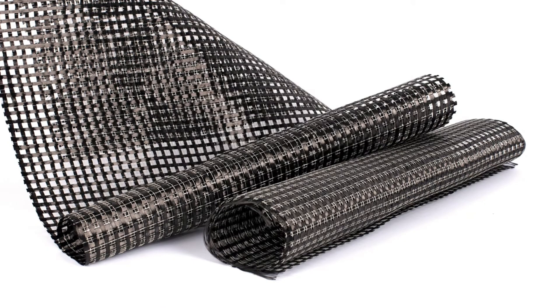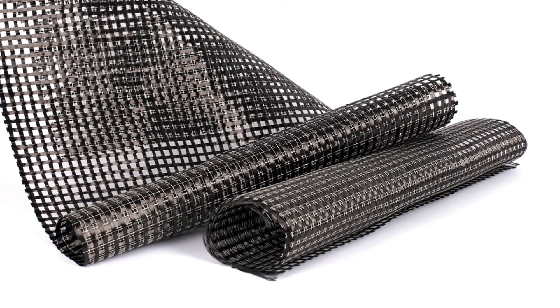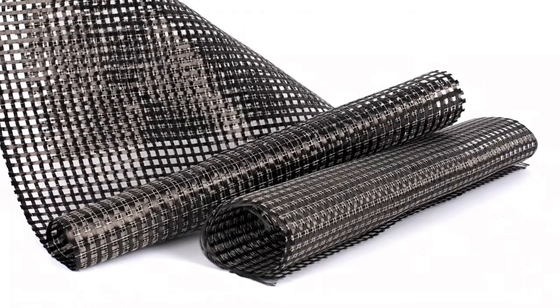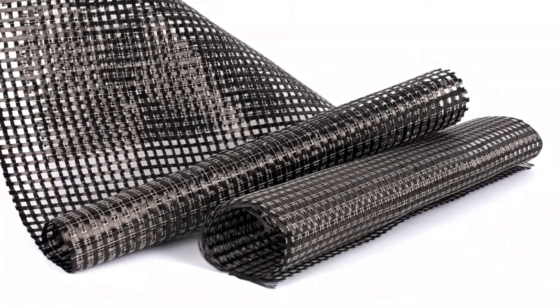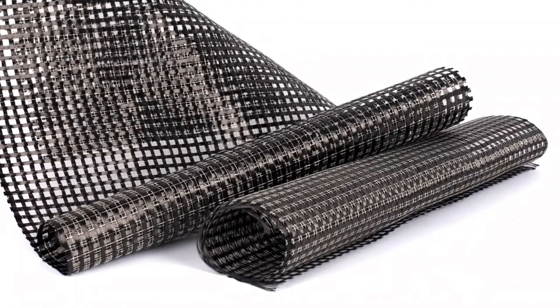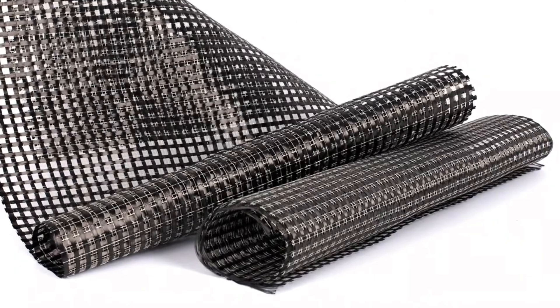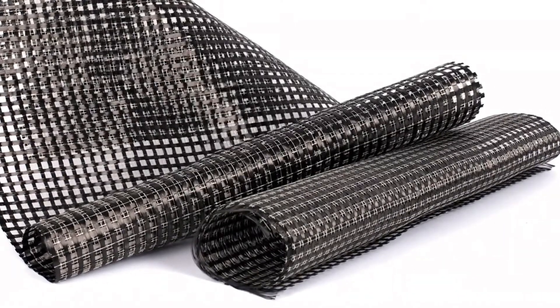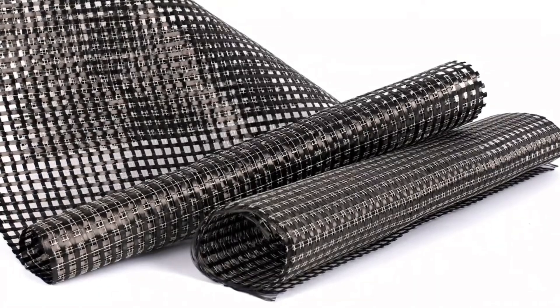For the preparation of C-Mesh 8484, you will find the carbon fiber rolls of 15 meters in length and 1 meter high — that is 15 square meters per roll. Open the roll and cut the carbon mesh to the specific required length using scissors. Remember when applying to allow a minimum of 10% overlap of the carbon mesh.